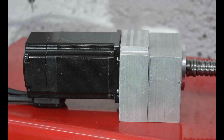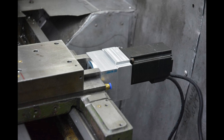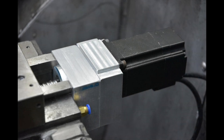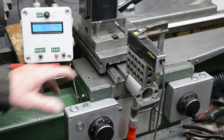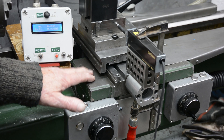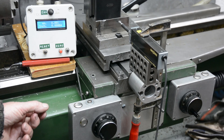There was no way I was going to run the lathe with the belt that tight because of the loading on the bearings and the ball screw. So what I decided to do was to fit the motor at the rear of the cross slide with direct drive. Originally it had a 2 to 1 reduction ratio through the belt; with the direct drive it's 1 to 1. I've now got it set up to test both the resolution and the backlash.